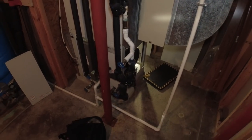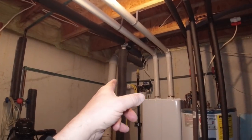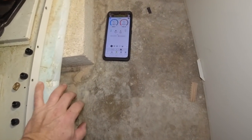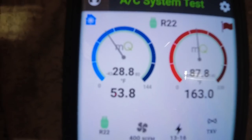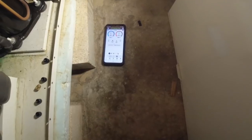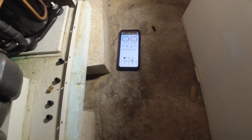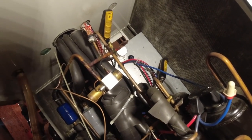I've got a solenoid on it, it's reduced flow - usually about a gallon and a half of flow per ton - so it's coming up over and going out to a tile field of some sort. The other circuit just kicked off, or I should say the pressures are a little more in line there. We're running 28 and 87 on that one - putting in your water temp gives you a ballpark.